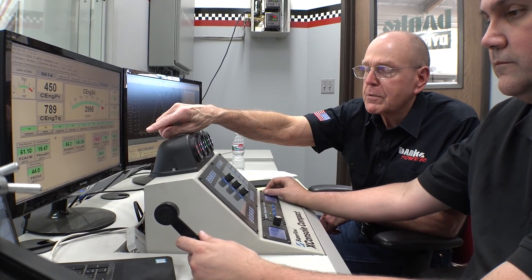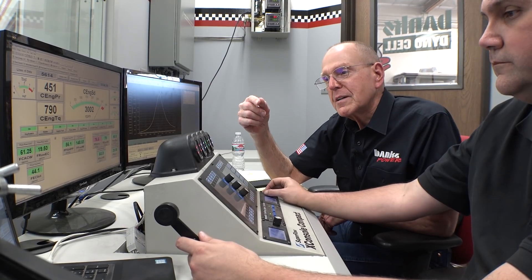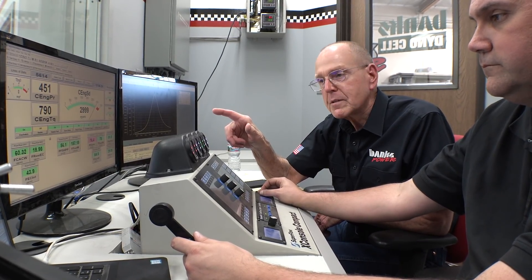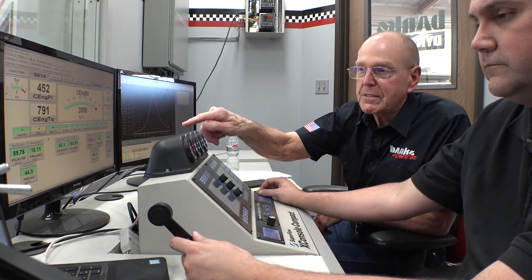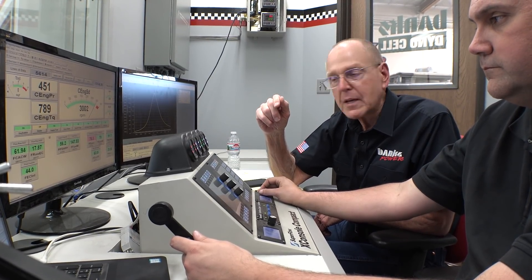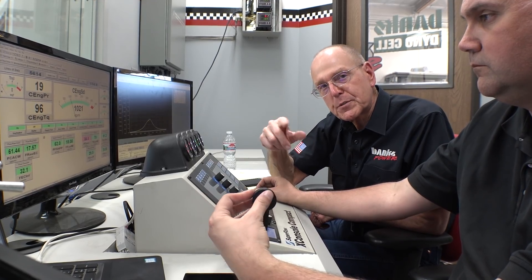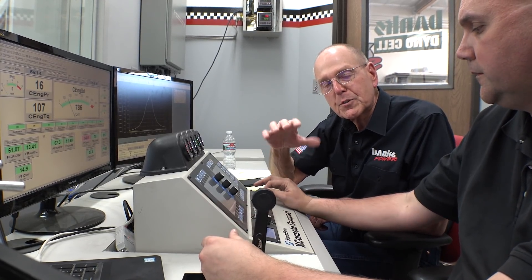What's with the coolant flow? I think we need to look at coolant flow and temperature gain across the engine coolant — something's whack there. That number should be much higher than 44 gallons a minute. I think we ought to back out of this and call it a day. I told you there'd be other systems that might cause some issues — we've got to catch that kind of stuff if we're going to get where we want to go.